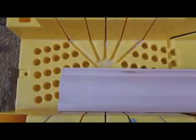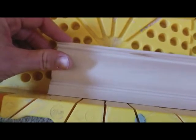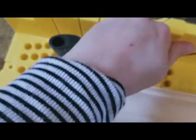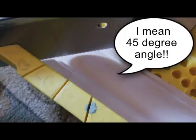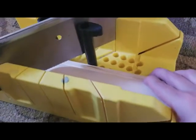One thing I wanted to mention is that you will be dealing with a lot of sawdust, so obviously the preferred place is outdoors. It's kind of cold outside so I'm just doing it in the house. I've got my board lined up to the 90-degree edge as close as I could get it — you see that line — and I want to edge it up close to there so I'm not wasting. Now I've got these pegs that come with the miter box, and they help secure the board from sliding — place them in the closest and tightest spot. Don't forgo them. Next I take my saw, use these slats as guides to create a perfect 90-degree angle, and hold the wood far away from the blade to stabilize it further.